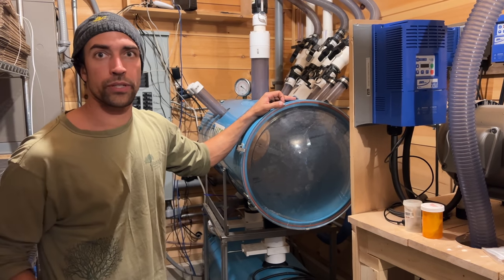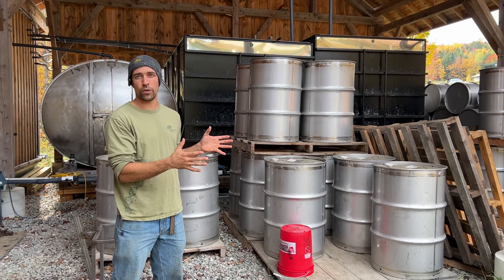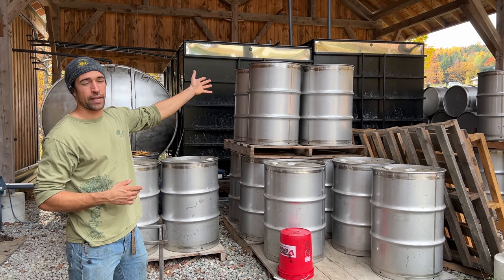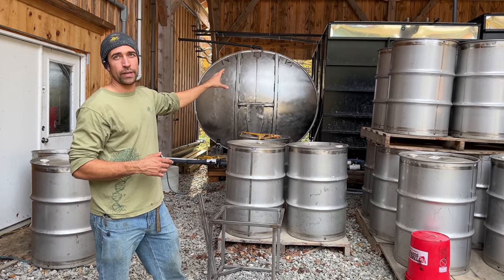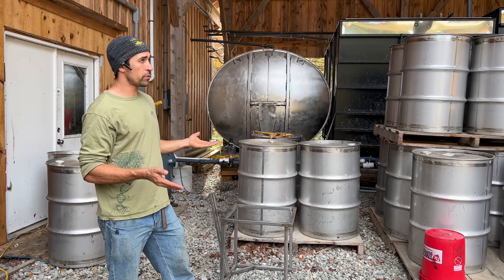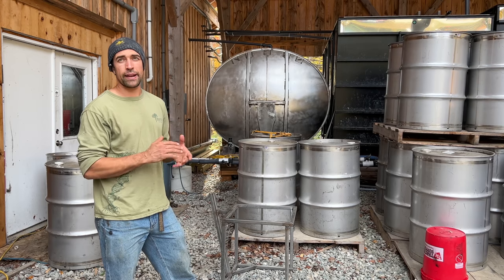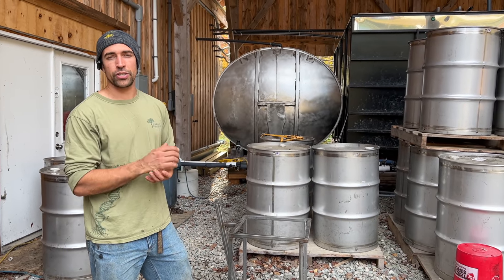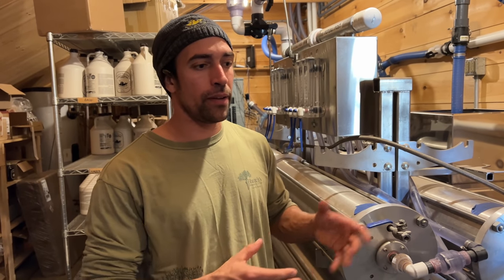The releaser is a delicate piece of equipment that needs to be housed in a temperature-safe environment. Once the sap gets down here to the tank house, it's stored in two 6,600-gallon tanks. We also have an old milk truck tank used to store permeate — the byproduct of reverse osmosis used for cleaning. We collect about 12,000 gallons of maple sap in 12 to 48 hours depending on the day, with the goal of processing it as quickly as possible.